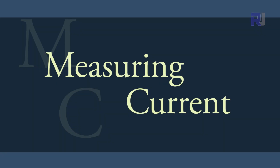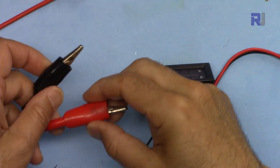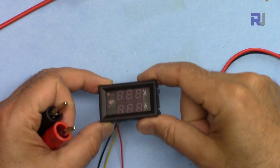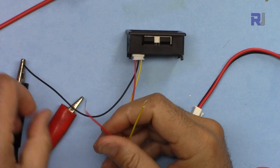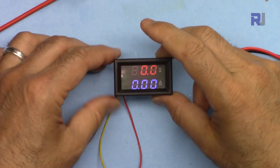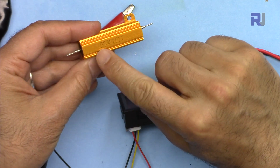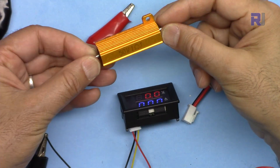To do the test, I will supply voltage using my power source at something above 5 volts up to 30 volts. I connect negative to negative and positive to positive to make it active. To display current, I'm using a 1 ohm 50 watt resistor. Its tolerance is 10%, so readings may vary slightly, but it's sufficient to demonstrate current measurement.